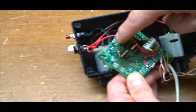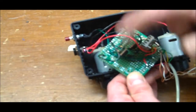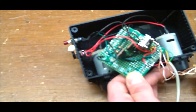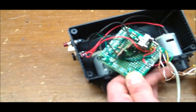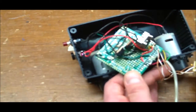On the Arduino digital pins I use 9 and 10 — they're PWM pins — going through a 1k resistor to the MOSFET gate, which switches ground to run the pump. I use analogWrite so I can PWM the pins; right now I'm running PWM at 255. I'll attach a copy of the sketch in the notes below.